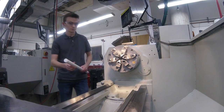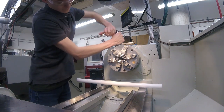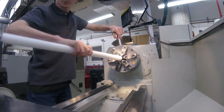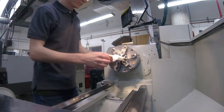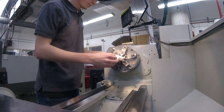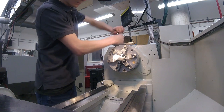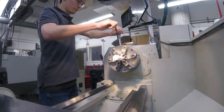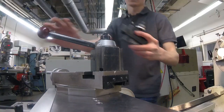I made my way to the lathe in the shop and loosened up the chuck with the chuck key. Then I grabbed a two-foot piece of Delrin rod stock and snugged it down, then grabbed a six-inch pocket scale to see how far I needed to stick my stock out so I could machine the part in one setup. Then I went ahead and tightened the chuck around the raw material. There are three chuck keys on there — you want to do all three of them.